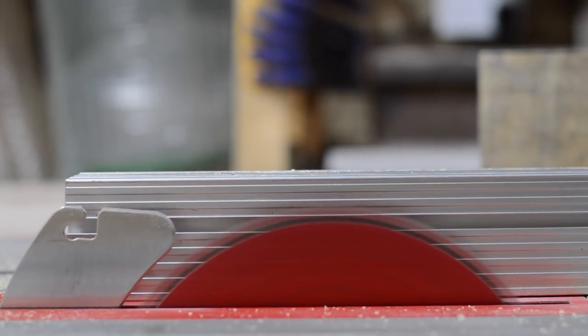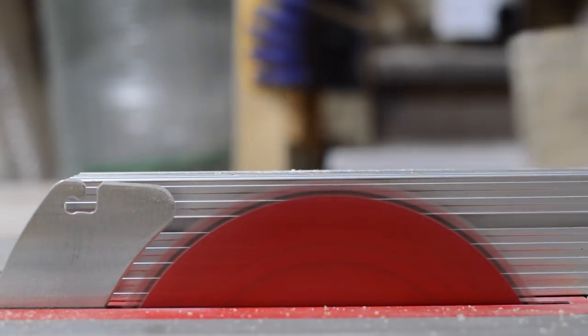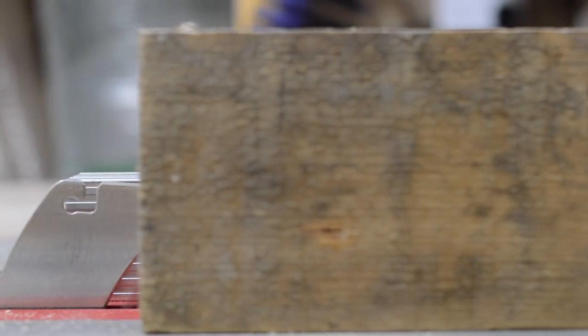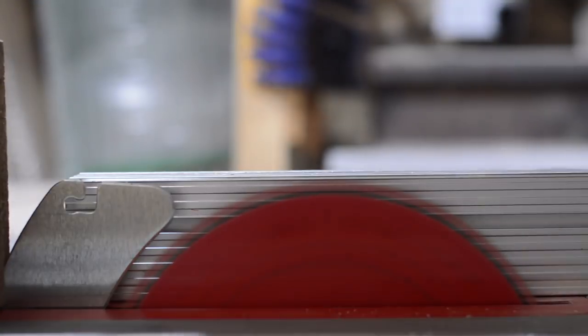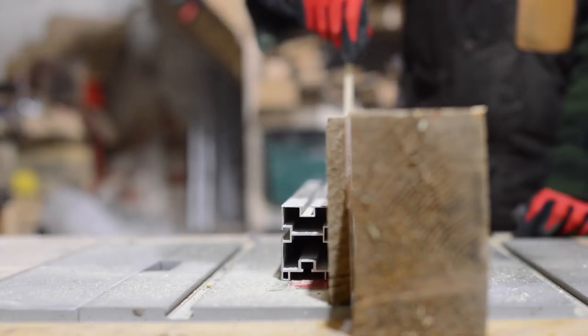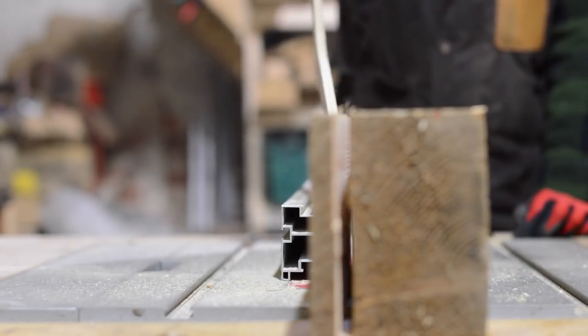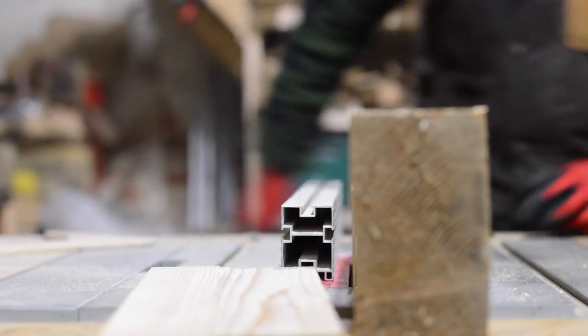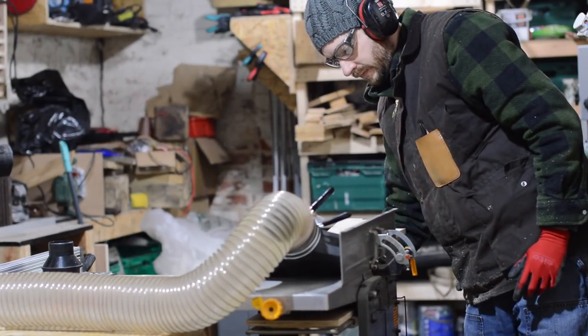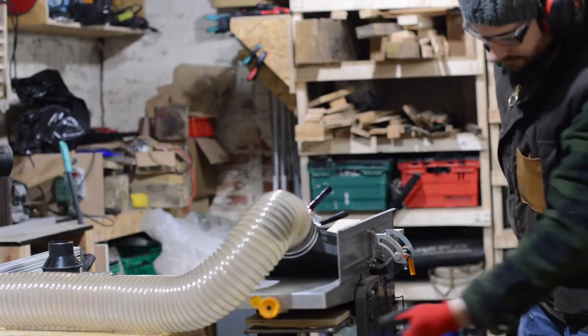I've been given this off-cut of old beam. It's made out of pine, so I just had to rip it down. I did multiple passes, raising the blade each time, and flipping the beam over and taking passes from either side. I cut the slice slightly larger than I wanted, so I could plane it down and get it perfectly flat, as the cuts of the saw hadn't lined up quite perfectly. I cut four slices like this, then planed them down all to the same thickness.